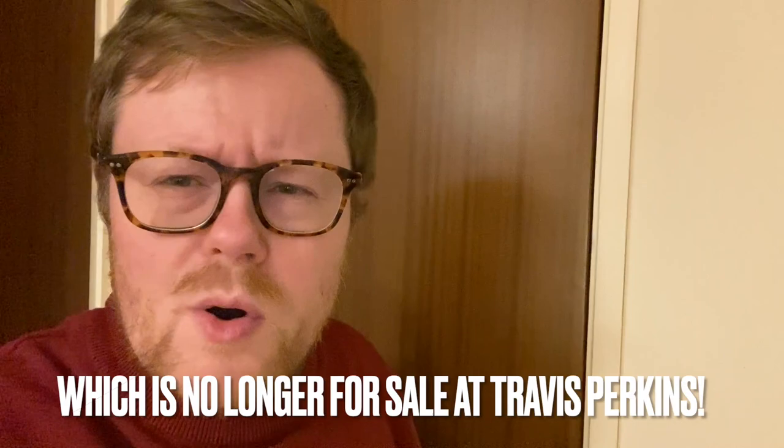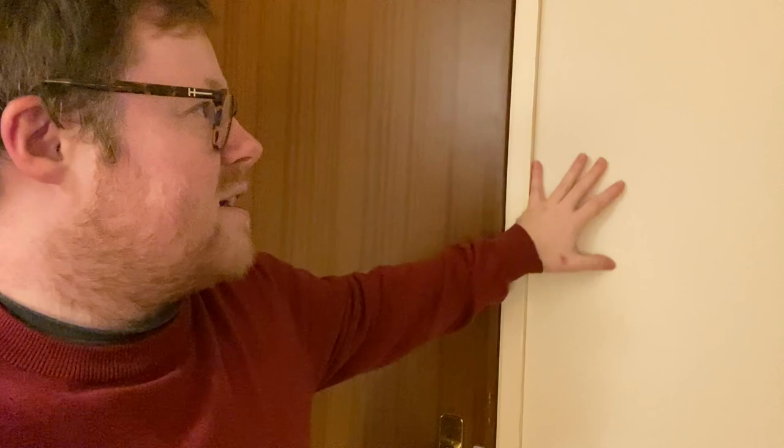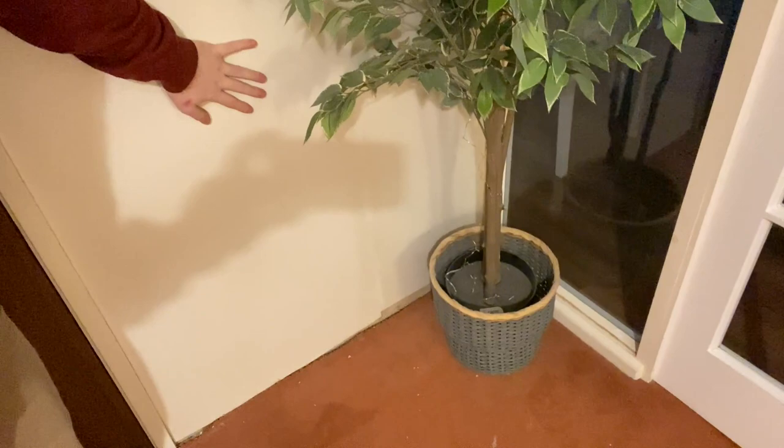It's possibly my fault for misleading the plasterer. I used cement backing board that said it was suitable for plastering. The plasterer put the skim on and it went like crazy paving across the whole thing, and he spent a good hour trying to stop it. In the main part he has, but there's a tiny bit at the bottom. My advice is: if something says it's suitable for plastering, you still need to tell your plasterer to put blue grit on there, which helps the plaster adhere better.